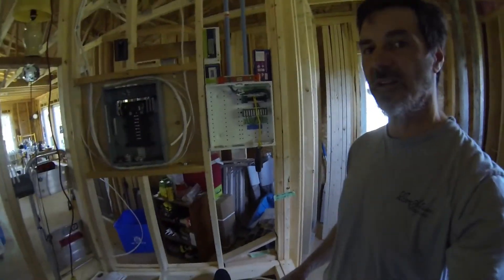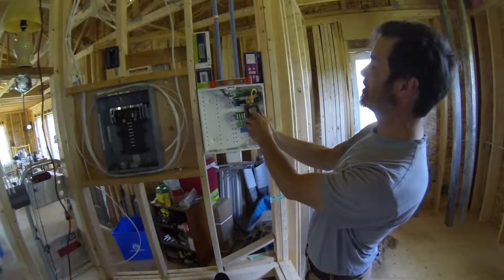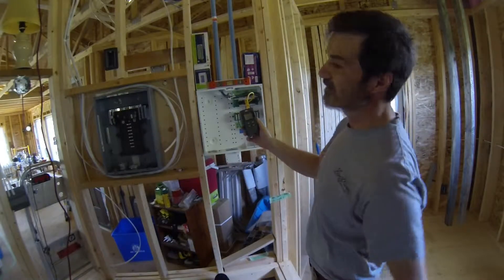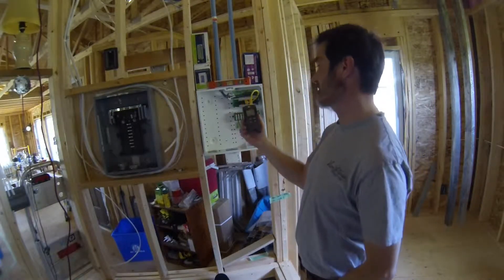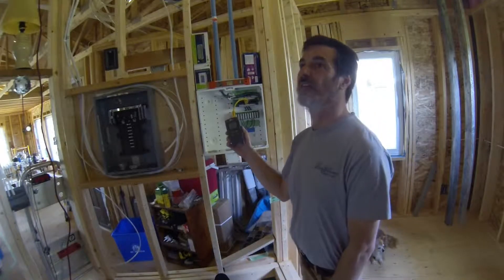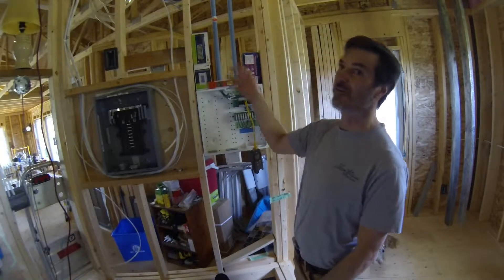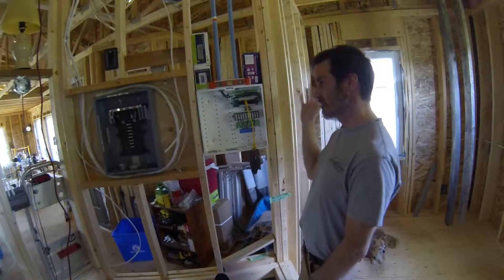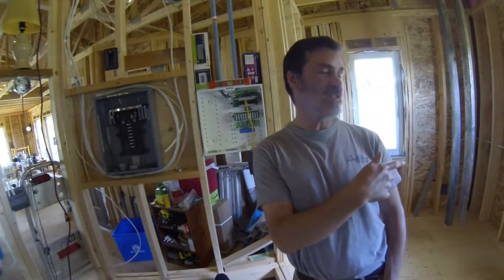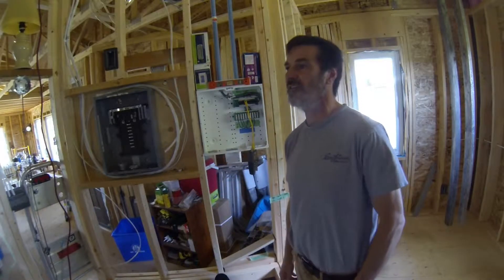You can see it's telling me it has no shield and pins one through eight have passed, which is awesome. It saves you so much headache — some people may have closed up their whole construction and then found out it might not be at the jack itself, which is easy to fix. It could be in the wiring along the run.